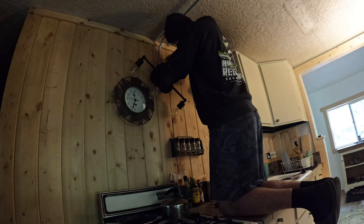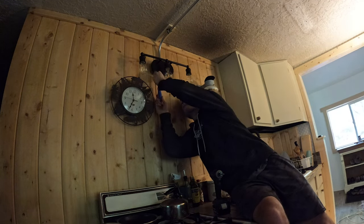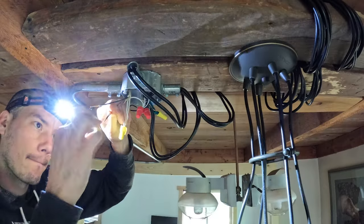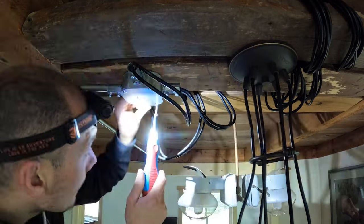That's why in your house you'll see labels on the breakers that say bathroom, kitchen, master bedroom, living room. That's because the outlets and the lights are separated amongst the rooms, and you'll have like a 15 amp breaker in your bathroom and a 20 amp breaker in your laundry room, because the washer and dryer take more electricity than you would use in the bathroom, right? These are just examples. So I understand that concept.